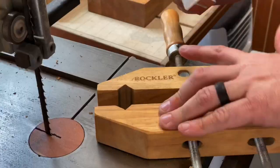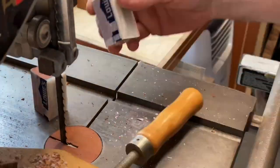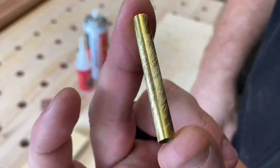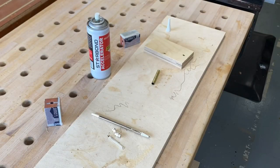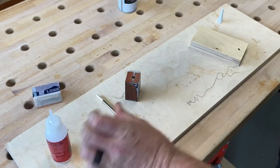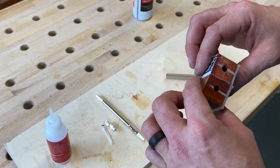To drill the holes exactly in the perfect spot, I'm using a screw clamp with a couple of 90-degree notches taken out of it to drill into these pen blanks. At this point I'm assembling what is actually a mechanical pencil — I'm going to make sure the pieces are just long enough for the brass collars to go in. We're going to rough these up with 150-grit sandpaper to give them a nice tooth so the CA glue — Star Bond — has something to grab hold of. I flood the surface with a little thick CA glue, shove it in place, and use a corner of a piece of wood to make sure it doesn't protrude out either side. Spin it around, plop it in, use that corner, and then give it a little activator.